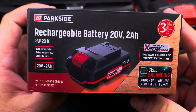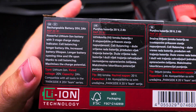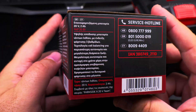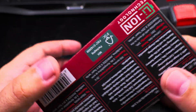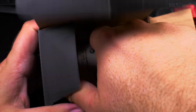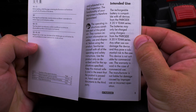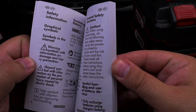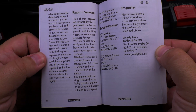There is something about the old battery: I was actually able to fully deplete it. Usually the safety feature that cuts power to the battery is in the tool for Parkside — I don't know why, maybe to keep costs down. But I believe the low-voltage cutoff should be inside the battery itself. The battery was showing red when I pressed the button, but it didn't stop me from using it, so I kept going until it was completely depleted.